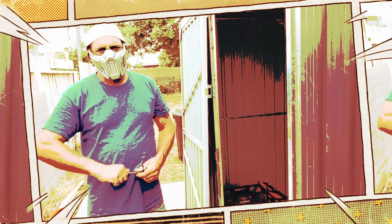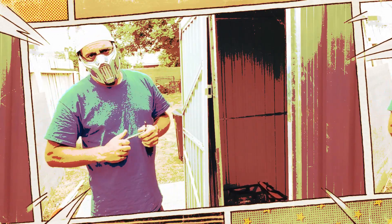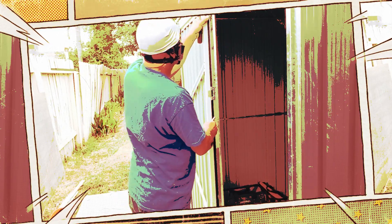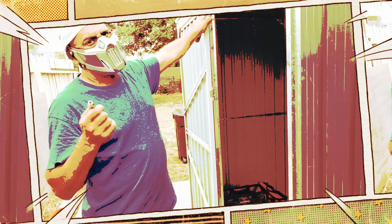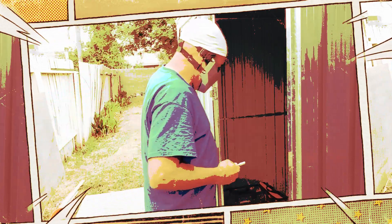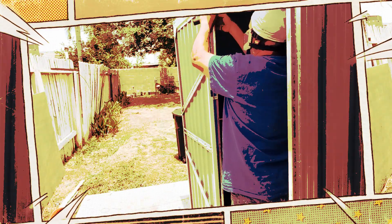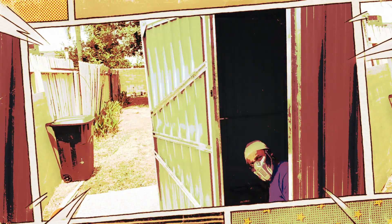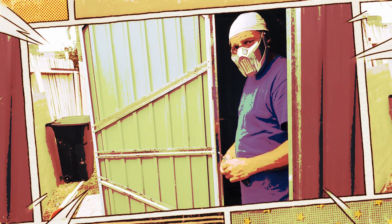Like we did before, a little tape around the finger. Then we'll be able to get the screw in place. We're getting ready to install the small door. We want to get this door set up to where it's lifted enough to be able to get the screws in at the top. Always put the top hinge in first — that way it actually holds itself up while you're working with the rest of it. You want it tight enough to where it'll actually hold, but loose enough to make adjustments. One screw in the middle hinge and one screw in the bottom hinge will give it more stability, then I can get the other screws in. Get the last screw in and we can tighten it down completely.